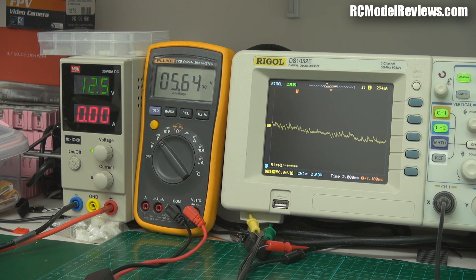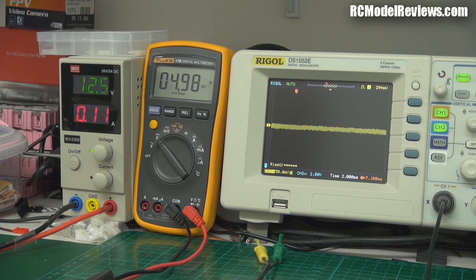Let's get it to 5.0 volts. It's quite a sensitive adjustment and you don't have to get it dead right. There we go — 5.0 volts, pretty close, I'm happy with that. Notice the voltage output noise is still relatively low — a little bit more than 50 millivolts but very sporadic, not worried about that. This is without a load, so let me put a load on now. I'll put some LEDs on there so we've got some drain on the supply, because supplies need to have a load to really show how well they function. With the load on, we're drawing 330 milliamps at 4.99 volts and we still have less than 50 millivolts of noise — that's pretty credible performance.